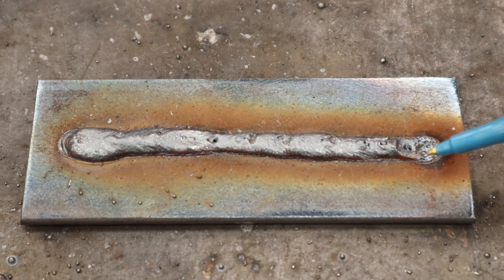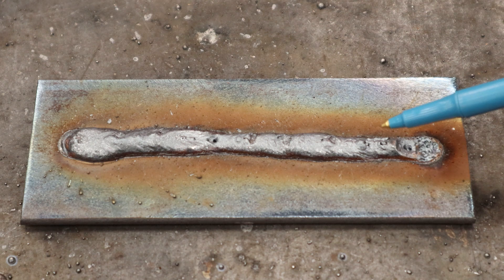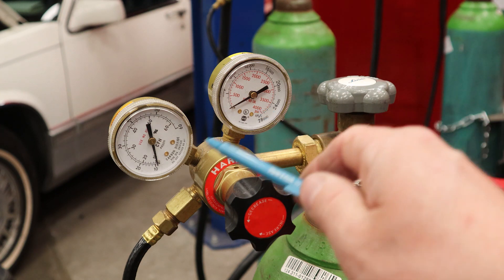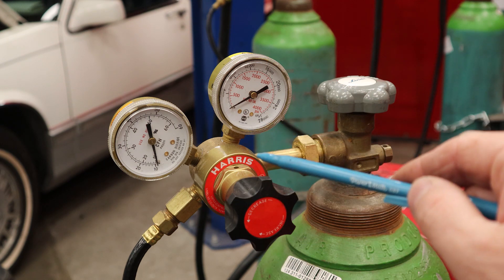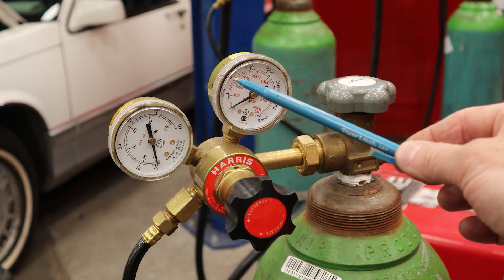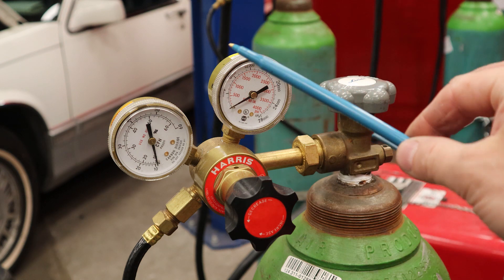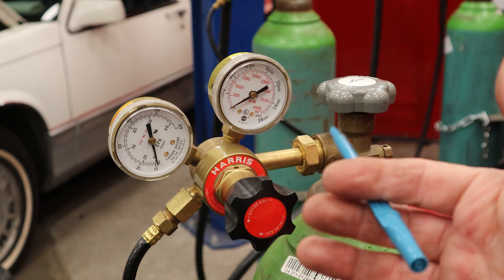The atmospheric gases and air are getting into our molten puddle and frothing it up before it cools and solidifies. If we wanted extra evidence, we refer to the bottle to see if they actually opened up the gas. Looking at the gauges, those needles are both at zero. Nobody bleeds these regulators out when done — they just close the main cylinder valve, leaving pressure in the gauges. Someone assumed the bottle was on, didn't open it, and the gas purged out of the lines dropping to zero. That is why there's soot and porosity in this weld.